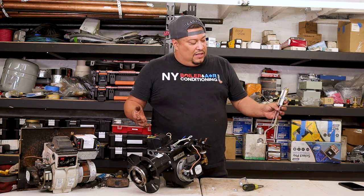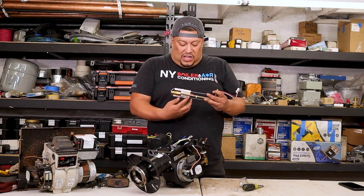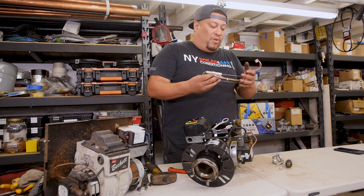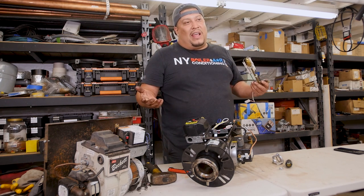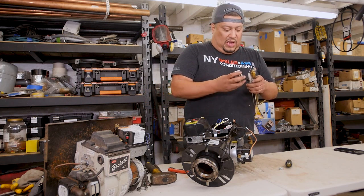If you're working in a commercial application, that burner would not be suitable. This is what a draw assembly looks like — very simple. Sometimes this thing does get clogged. I would always advise: when you take out the nozzle and replace it, clean it up. You could blow through it or use some air or nitrogen through this tube right here, making sure it's not clogged. It rarely happens, but it does. So I'm going to put it back together.